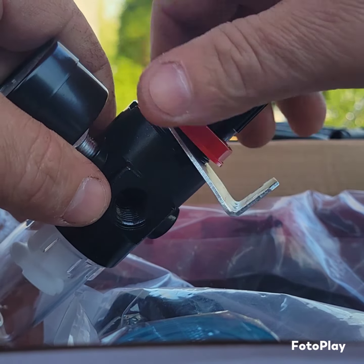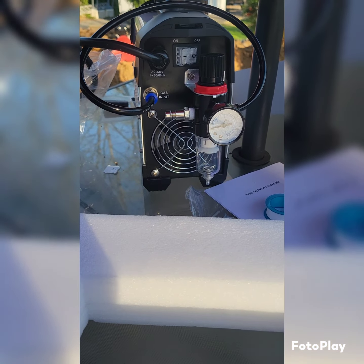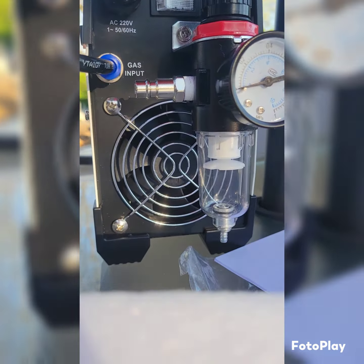This is just a SharkBite fitting — I'm going to slam that in there, just like that. Done. I'm going to give this a tighten. I wouldn't over-tighten that because the body's aluminum and you could crack it, so I won't go too crazy with that.